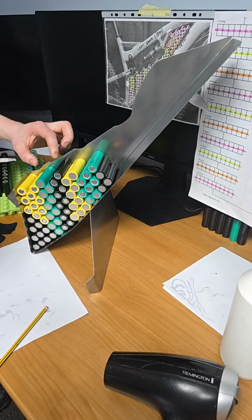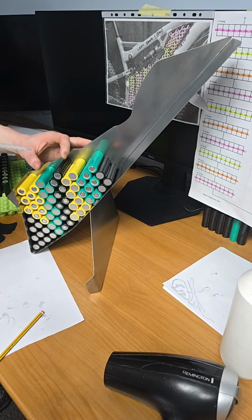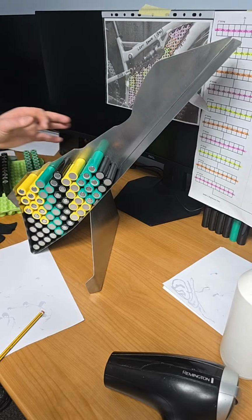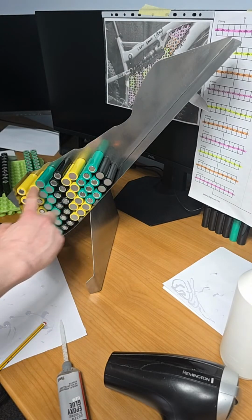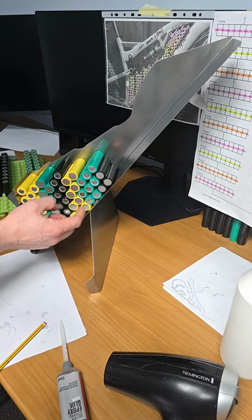Right, now I can do this side, but remember keeping the index finger on, wiping the end of the nozzle first. You don't want the glue over the rest of the cell here. Snap it away from the end. So that's that pack complete up to this point. Okay? 10 cells here, 10 cells here. Purple, yellow, orange. Purple, yellow, orange.